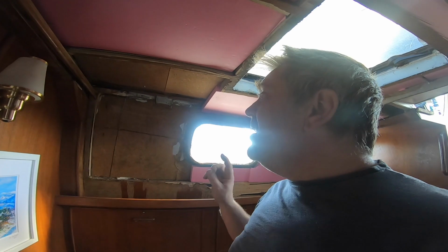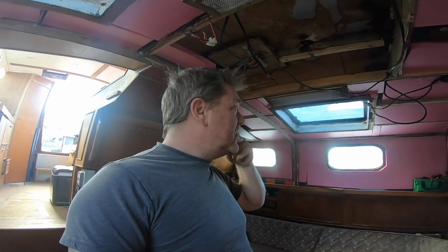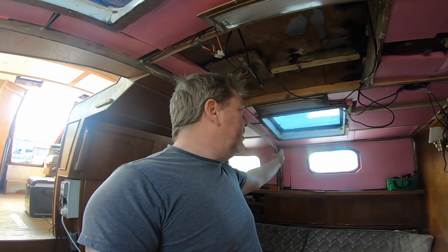You'll see. But my plan for today is to make the wooden panels to go around these windows and on the ceiling. I don't have the vinyl yet to cover them, as you know, we're putting wooden paneling and vinyl covering. But that's fine. As I've said in lots of other episodes, every panel is removable. I want to be able to take every individual panel down with a screwdriver so that we can get behind it to inspect the steel and to do repairs as necessary. So I'm going to make every panel that I need to make, and in that process make them easy to remove.